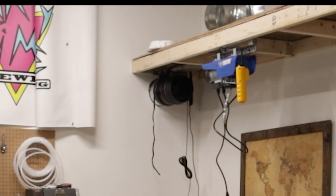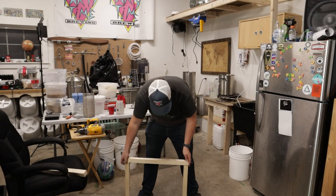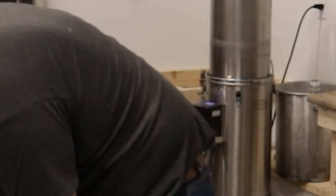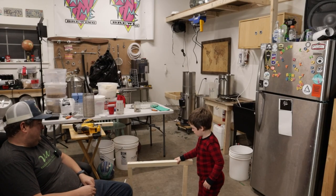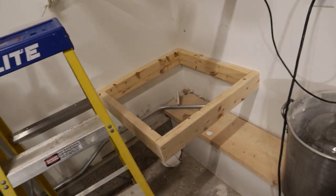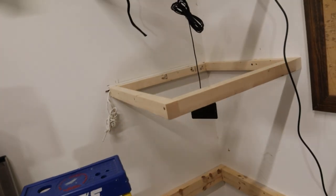Since I didn't really take any footage of it, here's a crappy zoom-in of what I did. You can see I have a fan hooked up there. In the foreground I'm working on new shelving — basically I wanted to put three shelves up. Down near the back there's a frame of a shelf already up there; it's a 2x2. I have a full 2x4 for one of them because I wanted it to hold the glycol chiller. The rest I just ripped 2x4s to save some wood — just two more shelves to give enough space so I can have two layers of Cambro containers on each shelf. The sturdy shelf I was able to stand my son on as-is, so it'll hold at least 50 pounds on the corner, probably good for 100 pounds or more on the whole thing. I'm going to put a brace coming down from the top all the way down on the corners, and that'll give it a little more support for the hoist.